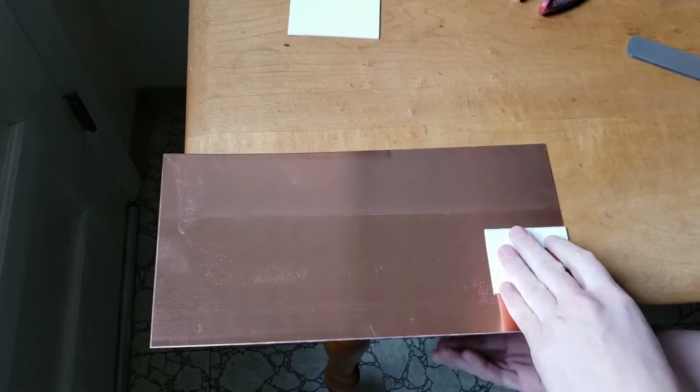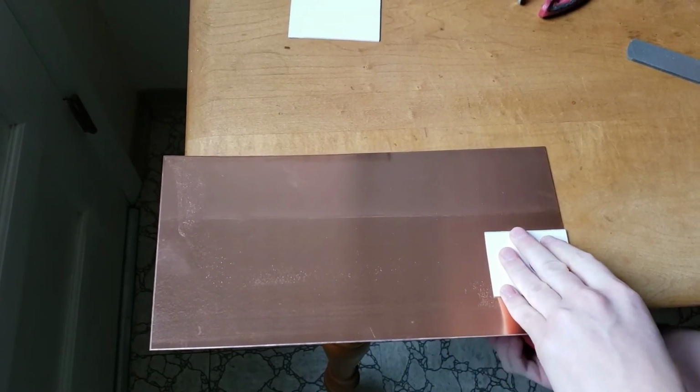The bevel should be smooth and filing should be easy. The file should glide over the edge. You don't need to force it. If you exert too much pressure, you can gouge the edge and leave a rough, irregular bevel that's sharp and can hold ink. After finishing the first 2 sides, flip the plate around and do the other 2.